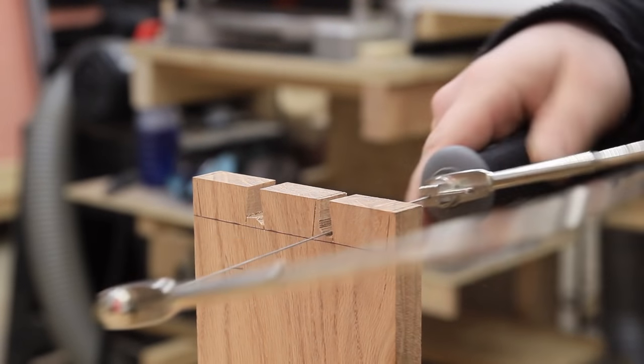And I can't get that type of consistency with a traditional Western style dovetail saw. This little guy, like I said, it's not a sponsored video or anything, but one of these little magnetic guides, very awesome. You get very consistent results so long as you saw on the appropriate side of your marking lines. So this is gonna go together very nice. There's not any gaps at all, and there shouldn't be any whatsoever once I clean up these inside corners of the pins and drive this home.